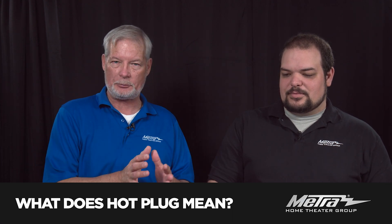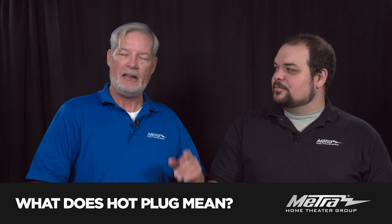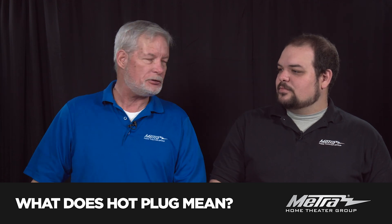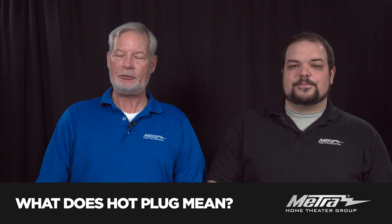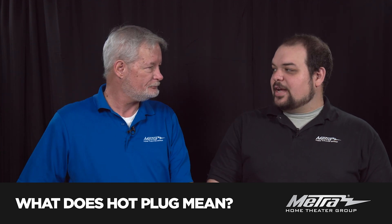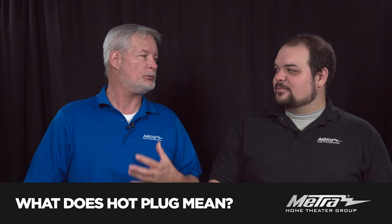Which is really nice. Before we get into today's problem, I want to emphasize: if you're using the AIO2 and you're not using the hot plug interrupt feature, please remember to put a jumper in the Phoenix plug. Because if you do not, you will not get a picture. Hot plug must be there.